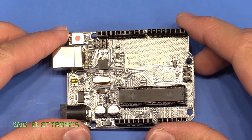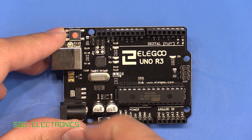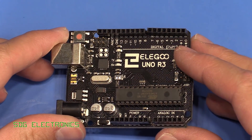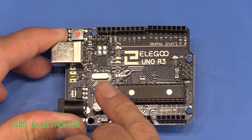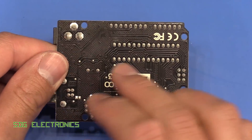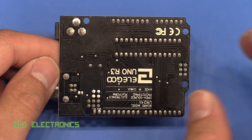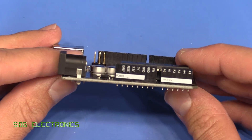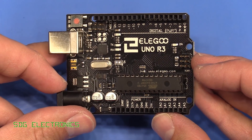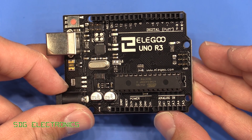I've never really used Arduinos but this looks pretty similar to what I've seen before. You've got the Atmel ATmega328P and then it looks like we've got a little chip here for dealing with the USB. There's not really much else on the board - we've got some voltage regulators, a crystal, and no other components on the other side. The PCB layout looks okay; I'm not sure if this is normal on other Arduino boards but you've got the hatched copper layer for copper balancing so that the board doesn't warp during manufacture. Everything looks absolutely in order and it looks like you can program the ATmega directly with the in-circuit serial programming port just here.